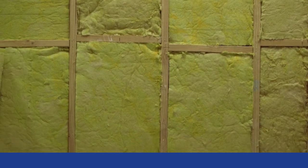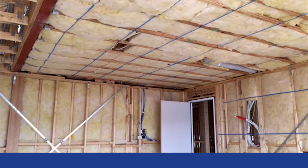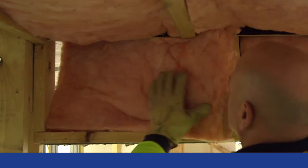Key checks and actions to remember when installing insulation bats: in ceilings, install to 50mm over the top plate. If installing before the ceiling is in place, like with a friction-fitted build, make sure the bats are supported. And when insulating the ceiling, remember to insulate the bulkheads.